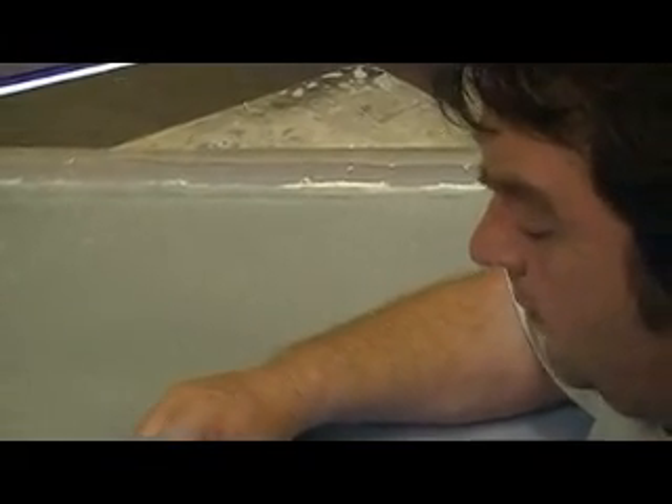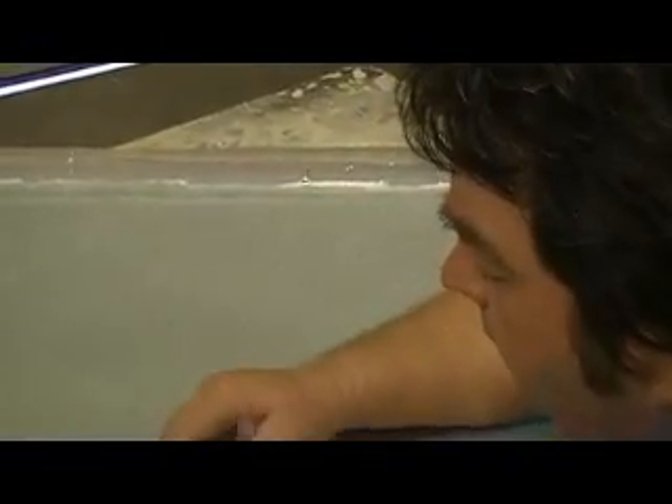The mold will come together all the way, but when it's dry all the way you'll have a real hard time trimming it. We've got to get it at that state where it's still a little bit soft yet, and it can just be trimmed with the razor blades. Wait too long and it gets hard — I've actually had to scrap parts because I couldn't trim them.